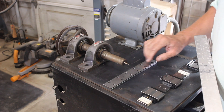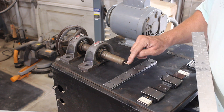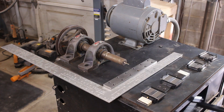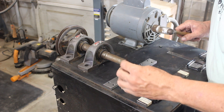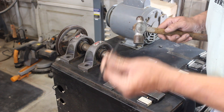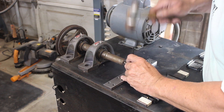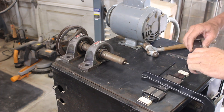I've chosen this location for the rail because I want the piece being cut to be on top of one of these bearings. We'll just square it to the base plate, then clamp it in place. Now it's square and clamped, and I'm going to come in here with a transfer punch and mark where all these holes go. Now the transfer punch is only for leaving a mark — it is not a center punch. And there they are: my 12 transferred holes.